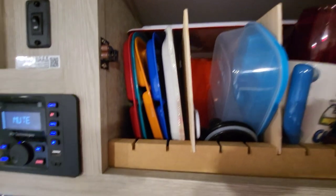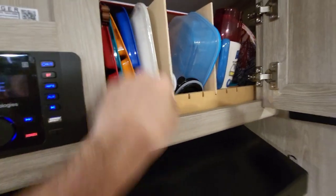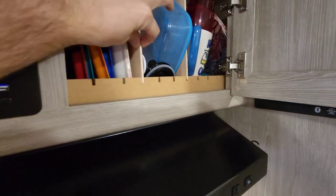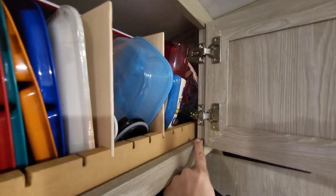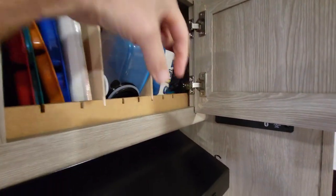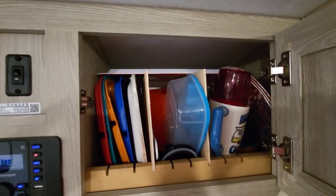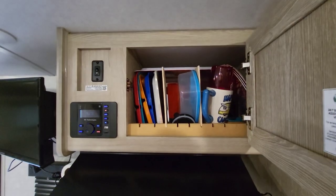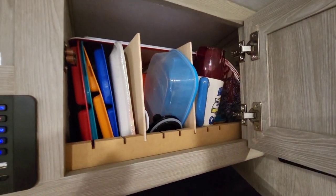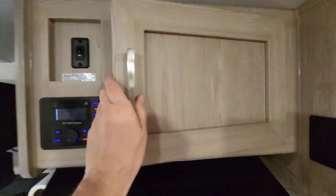It works in the same way as the other one. I cut a rail — MDF board — and I cut notches to fit my one-eighth inch Luan boards. So now I can add or take away these Luan boards as needed. There's just a small notch on the back that goes down to make clearance for it. And the very back side I put an actual literal wedge — I just shoved it down so nothing is glued or screwed in place. I can pop this out at any time, but it just allows us to break up that space. It's a really simple way of doing it. If you have a handsaw you can do this; if you have a table saw, it's just that much easier.